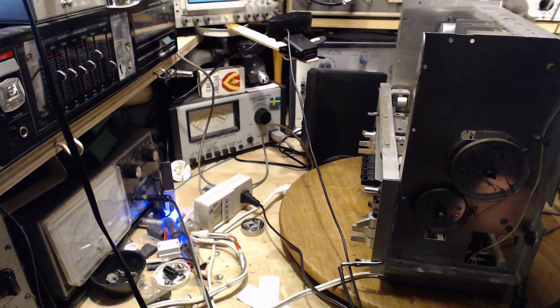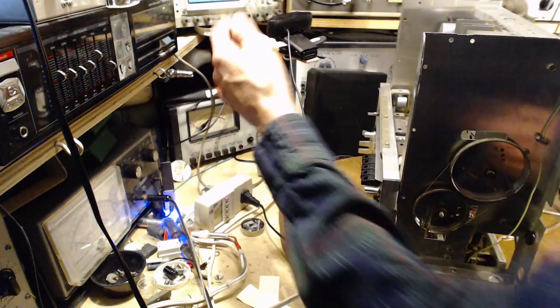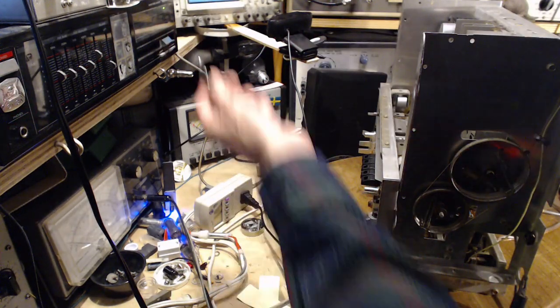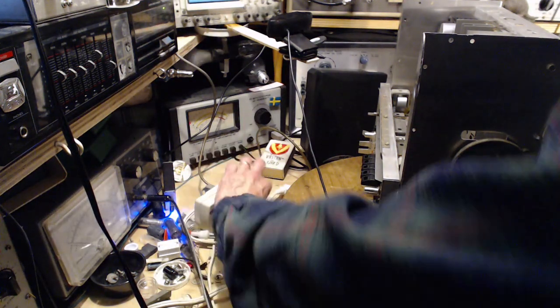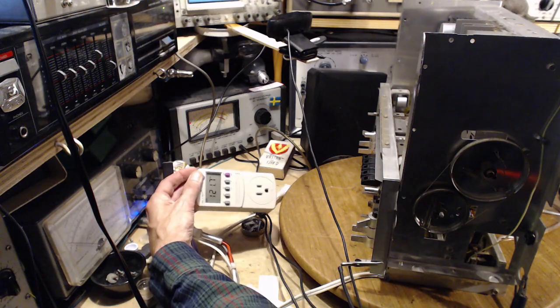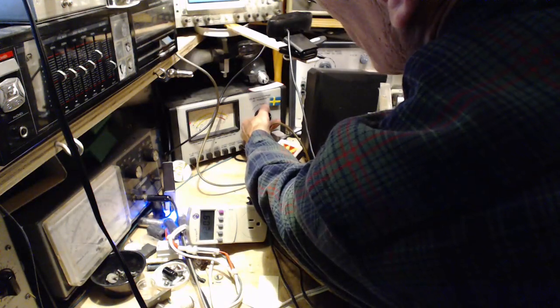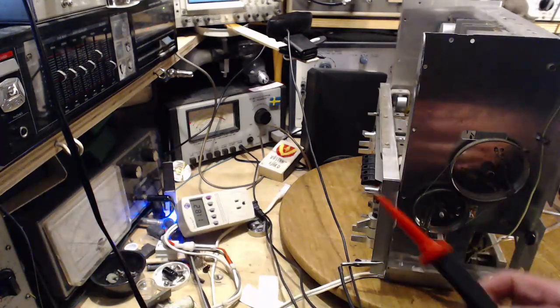So this guy has the ability to measure very small amounts of leakage current. I'm not terribly experienced at using it, but let's try it out. Okay, so this is a special leakage probe. Plug it in. Set this to output. This shows the voltage. Let me pull this out of here. Flip this on. No dim bulbs involved. 121 volts is what it says there. Nice red line there at, I think, 117. There we see 118 on here now. That's good. That's a good voltage.